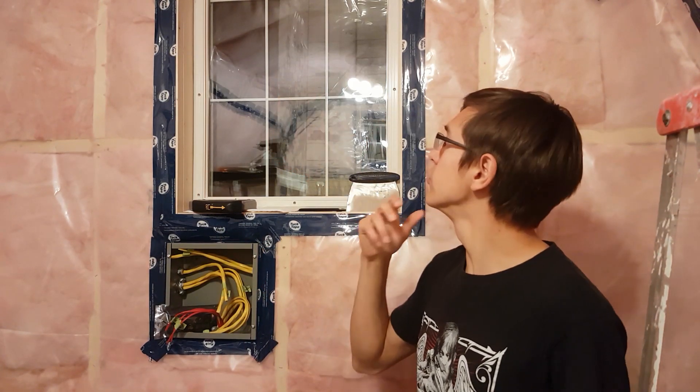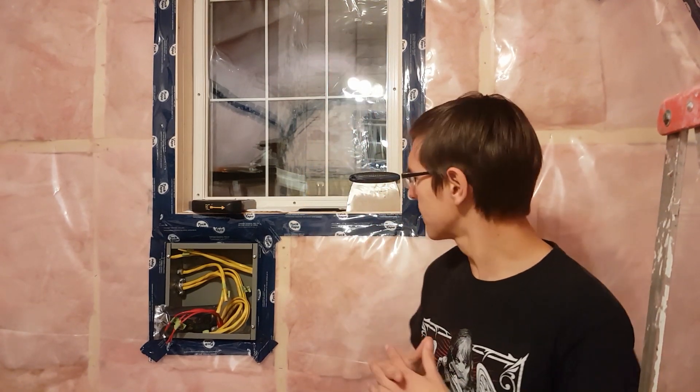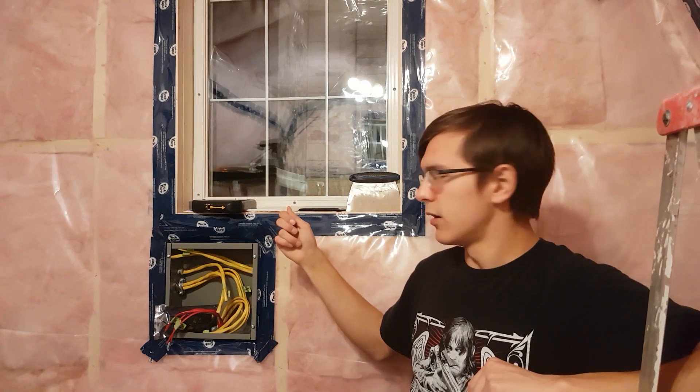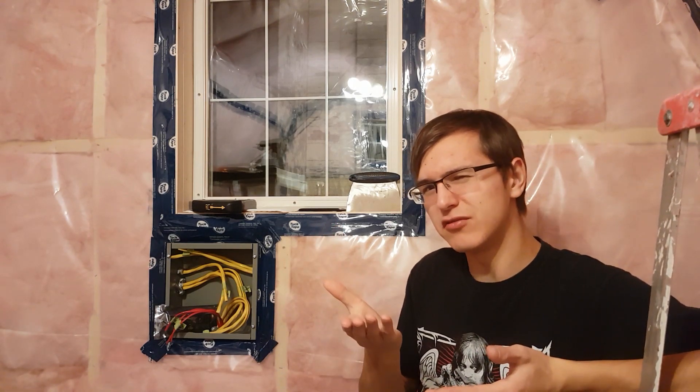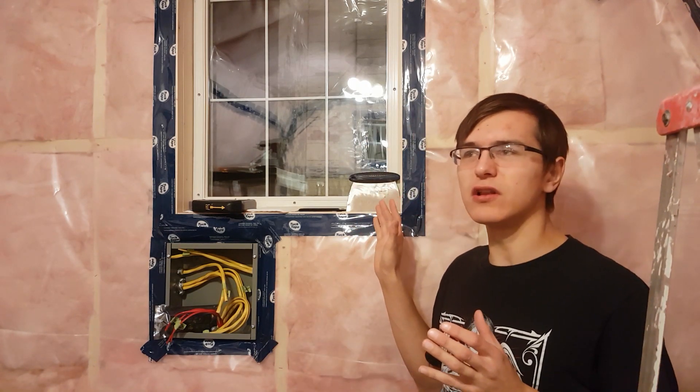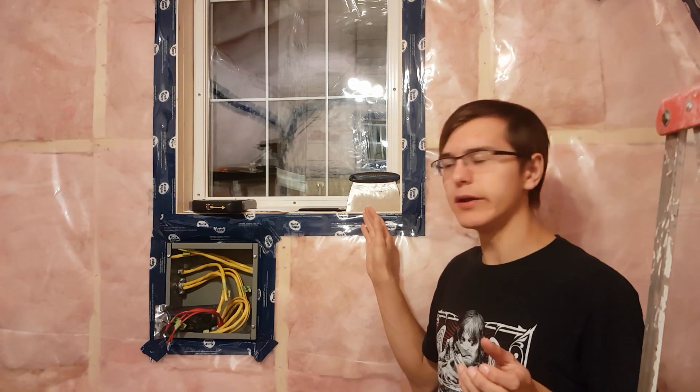This window here is actually quite large — it goes up to the ceiling, probably around 0.8 square meters. And funny thing is, this window is actually a big part of energy efficiency. You may be asking how a window, which isn't as well insulated as a wall, makes the place more energy efficient. Well, this is essentially like a solar heater. The sun, if I remember correctly, puts out around a thousand watts per square meter at sea level.